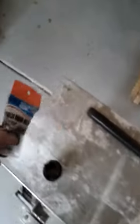But here's the tricky part of this build. This is a swamp cooler bushing. It goes right on the end of a swamp cooler. This is a sprinkler pipe riser, but it happens to be a 2-footer. And the cool thing about these bushings is they got an ID thread that will hold that riser. They also have a hose fitting.